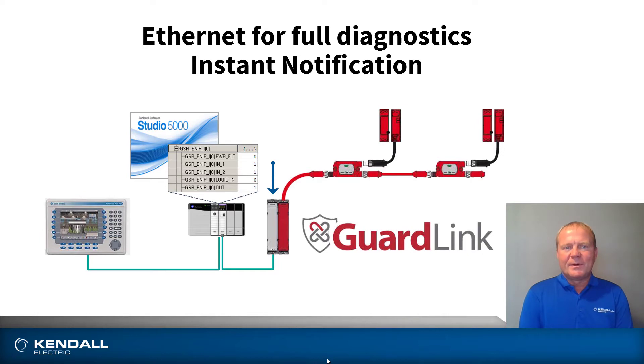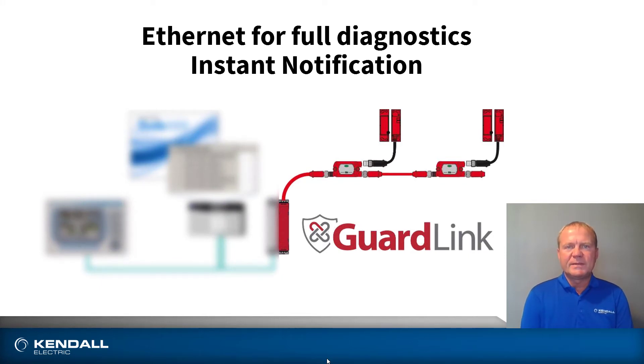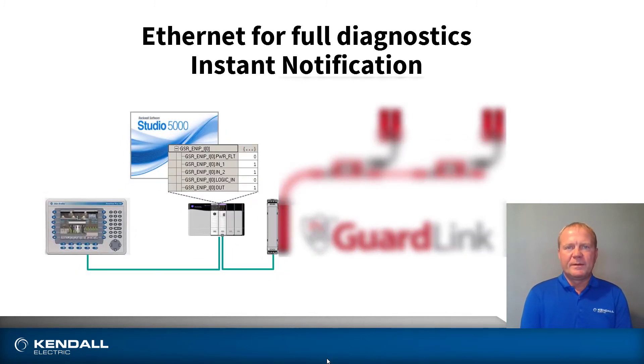Once you add the ethernet adapter, you can connect it to the Logix controller. There's an AOP for it, so you can easily access your tags to know which device is doing what, and then program your PanelView to display the status of the doors however you want. Gone are the days of walking up and down the line opening and closing doors — now you can do it all in an instant, shown on a screen so an operator doesn't even need to call maintenance. Note that the Logix controller here is not a safety controller — the GuardLink relay on the right side is the safety portion, controlling your K1 and K2 outputs for stopping the motor load. The left-hand side is all diagnostics. Lock and unlock commands can also be sent from the controller, since that's not part of the safety function.